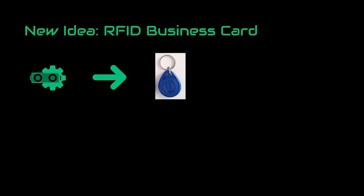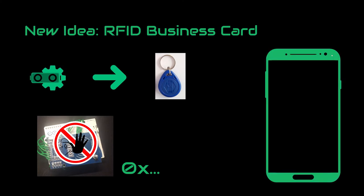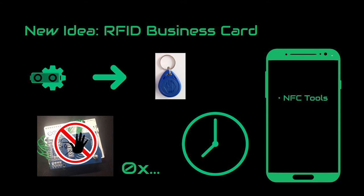To do that, we need to write our channel URL to our tag, but doing that on Arduino requires converting each letter from my channel URL to a single byte, and that is kinda boring and time consuming. So I left my Arduino aside and decided to move on with my NFC capable phone. It gives me flexibility to use apps, which saves a lot of time. After a fair bit of research, I downloaded two apps. One is called NFC Tools and the other one is called MIFARE Classic Tool. So let's look at how we use them.